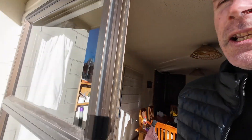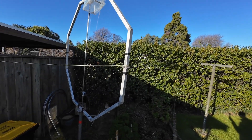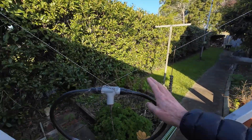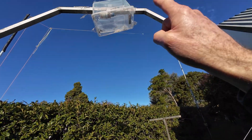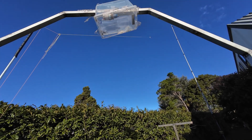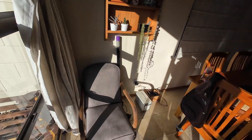What I've done here is I've plugged it into this antenna here. This is a magnetic loop antenna and it consists of two parts - it's got the main resonator part, it's got the coupling coil here, and at the top in a plastic box - which probably needs to be replaced by now - is a vacuum capacitor. We've got some coax going from the coupling loop through to the G90. The vacuum capacitor is a high power capacitor, quite common for magnetic loops.